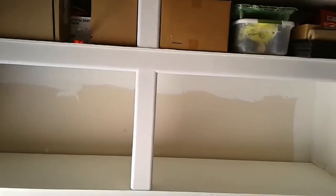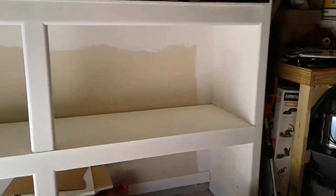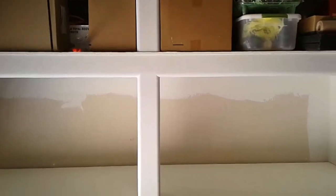The fifth step is to add your crown or whatever molding you choose. I'm using bullnose on this shelving because that's what runs through the rest of the house, so my shelf will exactly match the bullnose in the house interior. I'm installing bullnose in my garage for the exterior of this portion as well. You can see how I already have it — it looks really awesome. The fifth step also includes texturing it to match the texture already on the garage walls.